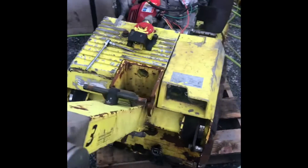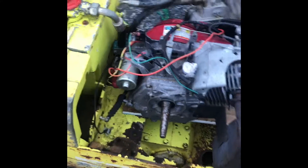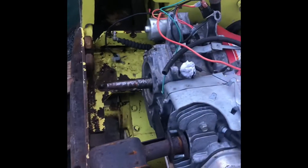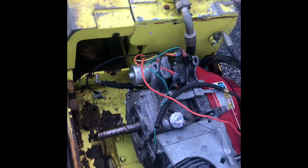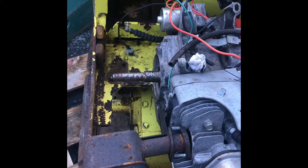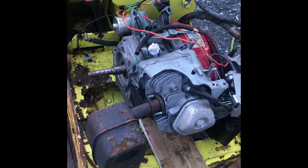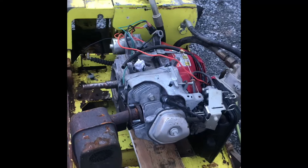Here's what we're thinking for the motor - a little GX390 to replace the missing little Hatz diesel single cylinder. Depending on the exhaust and everything, I'm going to think about moving that hydraulic pump over to this side so I've got more room, and I've still got access to the air box and the starter. There's a loop that goes up and over right there - I'm going to have to modify that to fit. I think I can snake a lot of the hoses over to the other side down below and come up with a configuration for the adapter from the engine over to that hydraulic pump, which is going to be mounted right here. I just need to drain the oil and take the pump off to do a mock-up with the cover.